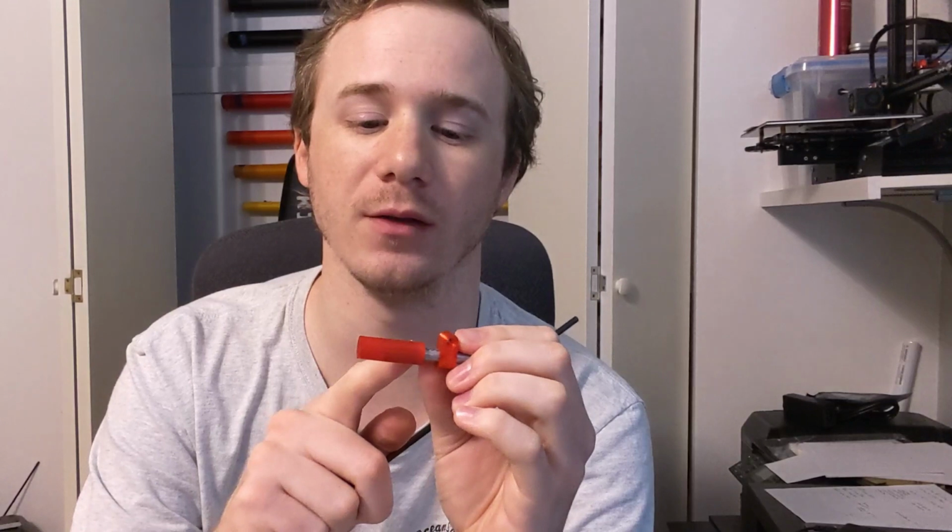So I did this, right? I made a new model that basically has a hole that goes all the way through it that changes diameter in the middle here. So on this side, the diameter fits my 4mm pultruded carbon, and on this other side, it fits my aluminum. So I can shove this guy in. It takes a bit of effort, so we've got some grippiness, but I've still got the rigidity of that aluminum, and it seems like this is going to work pretty well.